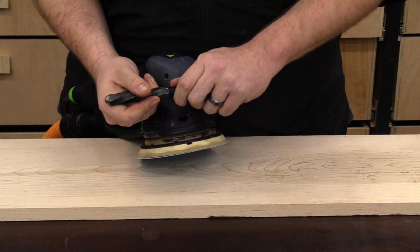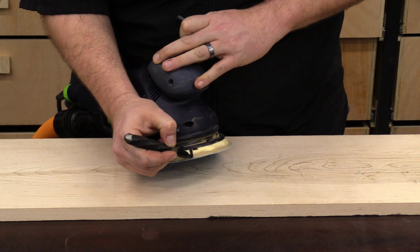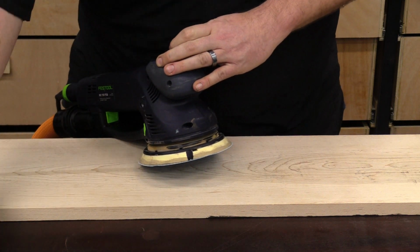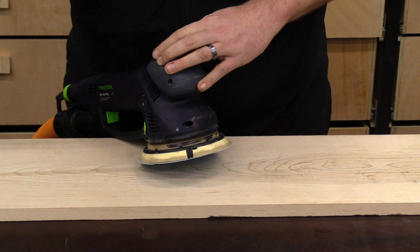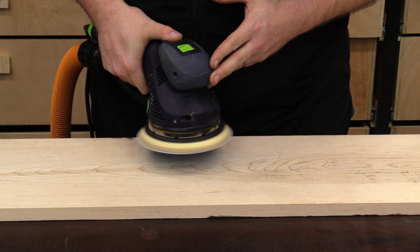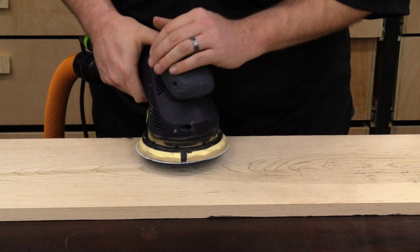So what you can do to test yourself to make sure that you are sanding properly is to make yourself about a 1/2 inch wide mark. Now in this case we have a white pad, so we use a black Sharpie. If you have a black pad, a silver Sharpie will come in handy as well. What it'll do is show you when it's orbiting properly; you shouldn't see the black mark.